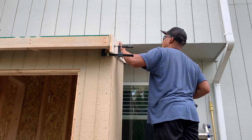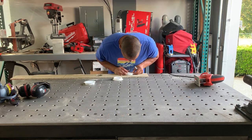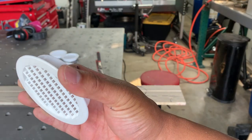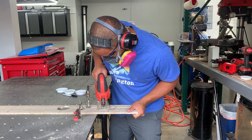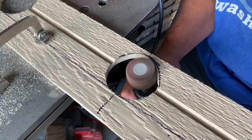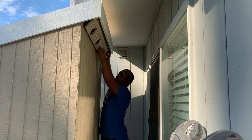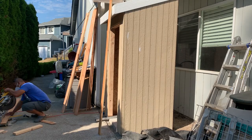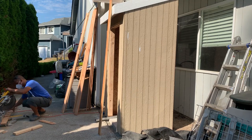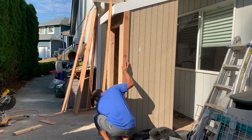I installed the trim sides first, then the front, then the back. Next was to install the soffits and soffit vents — this is the piece that covers up the opening on the underside of the rafters. The soffit vents help make the shed breathable and provide some air circulation. For the exterior trim I used some leftover 1x4 fencing cedar trim I had laying around. There are other better, more expensive options like fiber cement and PVC trim if you want something that will better withstand the outside conditions.